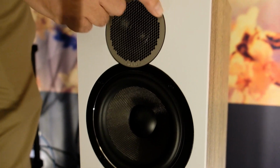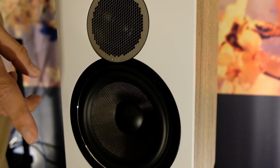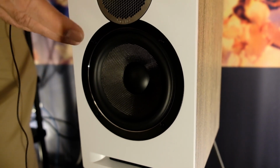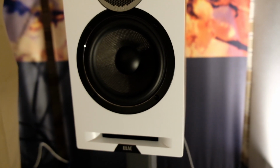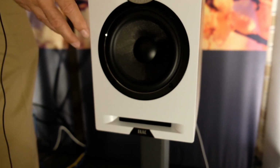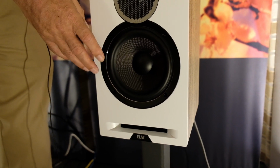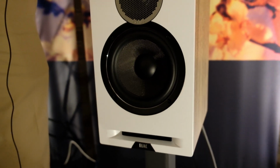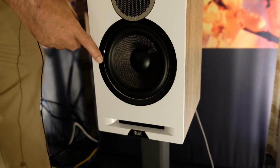There's a slight recess here. It shouldn't be there because this is my prototype. Yep. The woofer is the same moving parts as the woofer in Debut 2.0. So same cone, surround, voice coil, magnet. Slight change in the spider, both to accommodate this new chassis, but also improve the bass linearity at the bottom end. But it's built on a cast aluminum chassis.